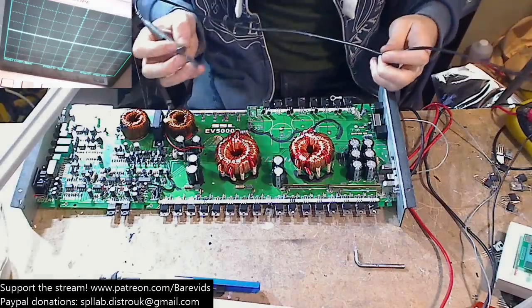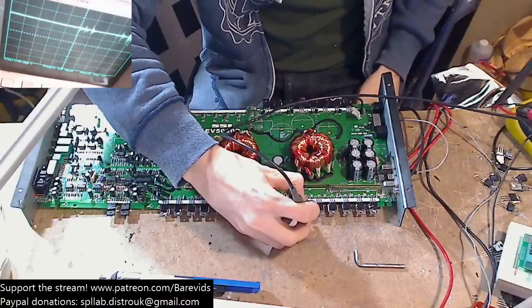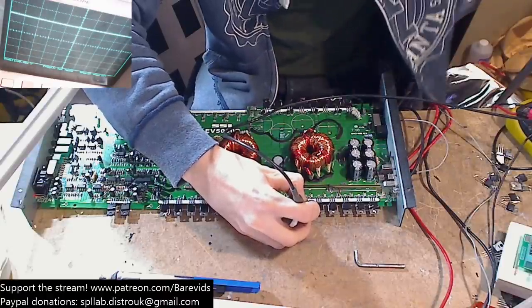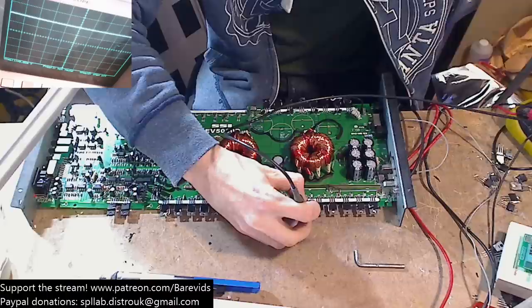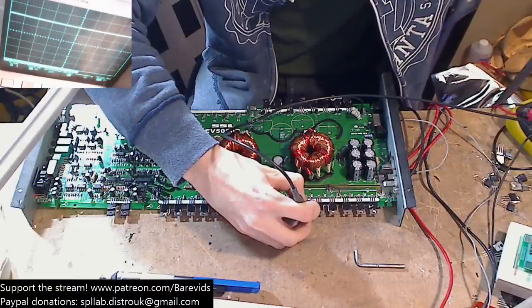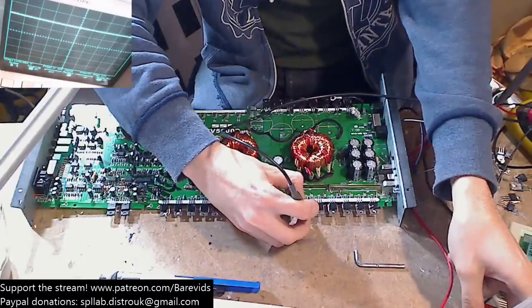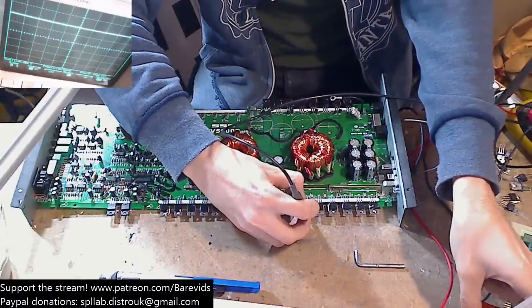So we're going to apply some remote voltage now. Let's see, does this thing come on? Okay, there we go. So we can see we've got a drive wave building there. Can you see that there? It doesn't look very happy, so I wonder whether that is because the current limit is too low. So yeah, it's limiting the current and we're dropping down to 8.4 volts.